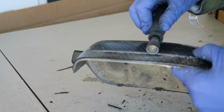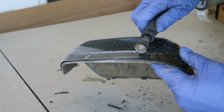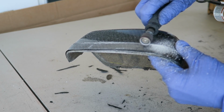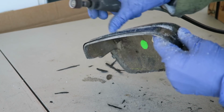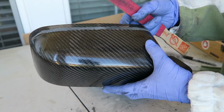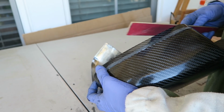But these kinds of lips just don't transfer very well. The carbon fiber just does not want to press into that edge. It ends up getting some extra pooled resin with air bubbles or just being dry, so it's not the best type of design. Even with the vacuum pressure, it just doesn't want to press into such a sharp edge.